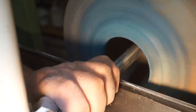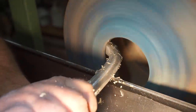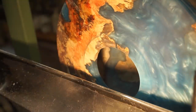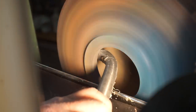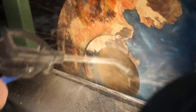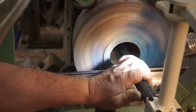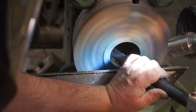At this stage I'm taking the laser off because it was hitting on the bar above - no point in keeping it in play. I think laser systems are fantastic - kind of takes a lot of the guesswork out of it. You can set that cutter at a half inch and go until the laser dips off the side of the bowl and you know you've made your half-inch wall thickness, so it's not as risky as doing it blind. I'm just using the boring bar for a last little bit of cleanup in the very base before we start sanding.